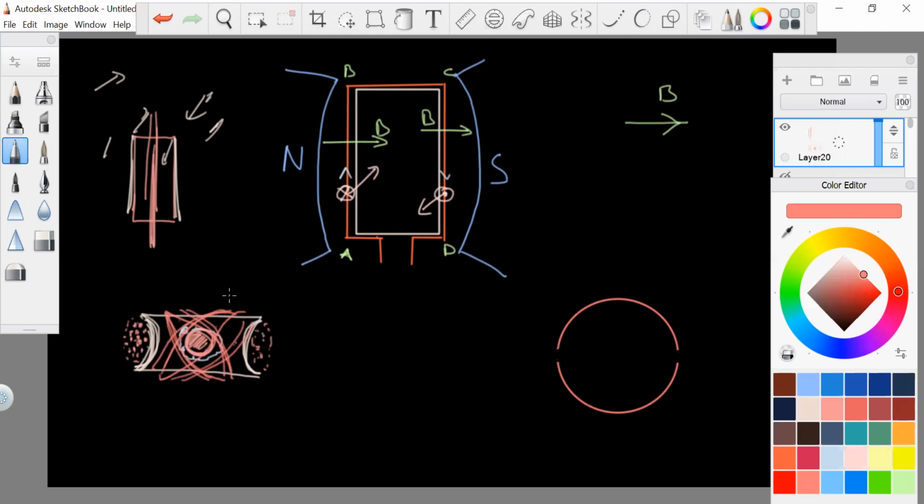Do not cut and join the pieces of the wire. It has to be a single, long one. Get the point? If you cut and join, you have to scrape off the enamel, join properly, then put some coating on it, say wax, wrap it around and check the connection also. Don't do that much, okay? And let it be neat. Wires should not be flying out here and there because they are all going to hit.